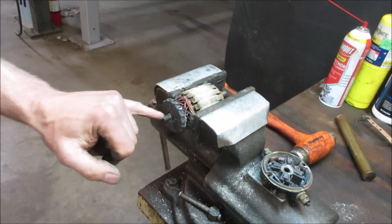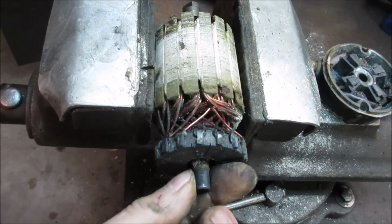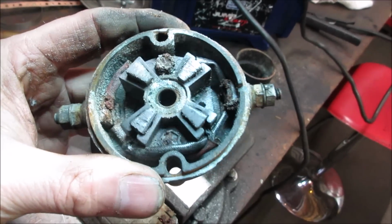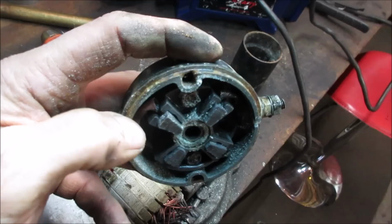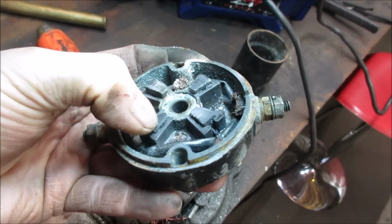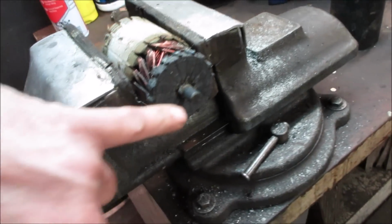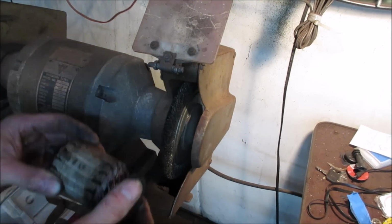Yeah. Let's find if we can get maybe a little brass wire wheel. We'll try cleaning this armature up right here. It probably should look something like that on the other end. What do we got going on here that we can deal with? Probably run a wire wheel around the seal. Probably we can seal it up with some kind of Right Stuff or something. And these should float. They do. Good. All right. Let's start cleaning this and we'll come back and see how we make out. So far, so good. I'll try to get the big stuff off.